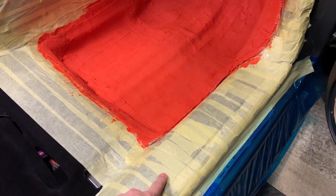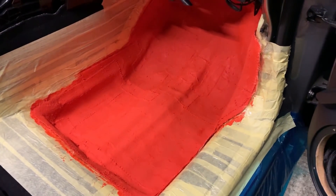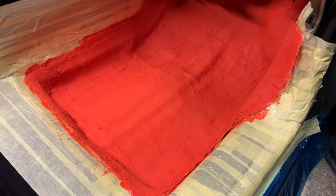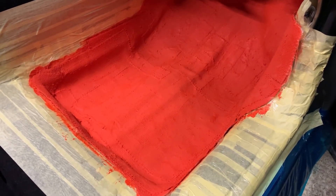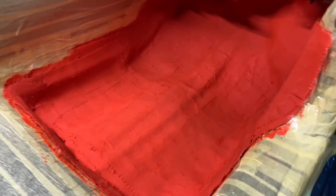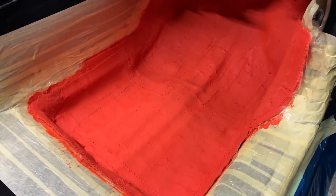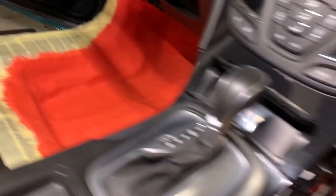The floor got a layer of masking tape, then two layers of resin proof tape, and then three to four layers of chop mat — the 800 gram per square meter, pretty thick woven mat. It's looking pretty good. Now I can come out, get it trimmed, and you will see the next steps. That's the other side by the way.